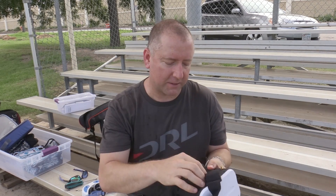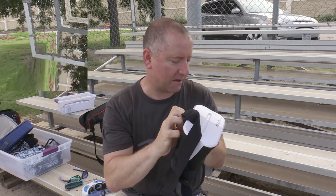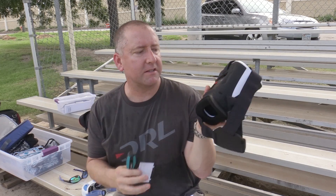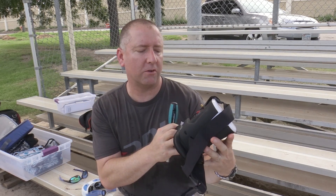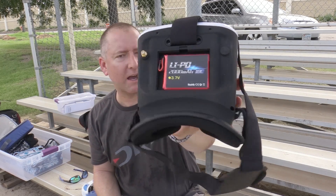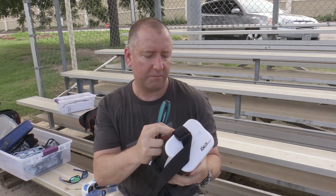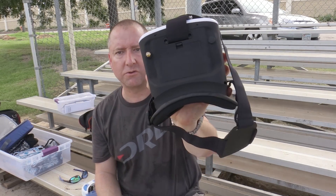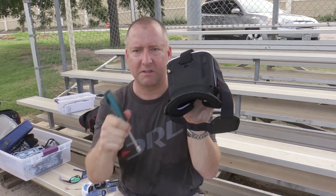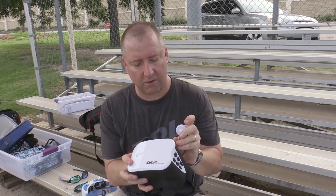They do have a removable battery right up here in the top — it's a LiPo. It's a 3.7 volt, 2,000 milliamp hour, so it's a 1S LiPo battery that goes right in there. I believe it has a JST connector, so it's a pretty standard connector, and snaps in well — no screwdriver required. They also come with a cloverleaf covered receiver antenna, which screws in right here.